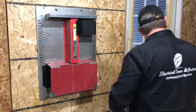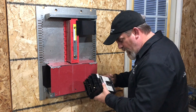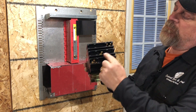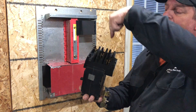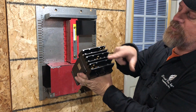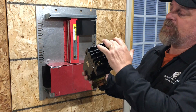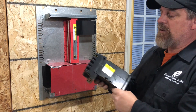This is an i-line circuit breaker, 100 amp, three pole. Now we've got a new breaker — before we install it, let me give you a breakdown. You can see these little inserts: these insulators separate A, B, and C phase. There are little copper jaws inside that will actually connect to the bus bar when we slide it back in the panel — that's how you make your connection and insulate between those connections.